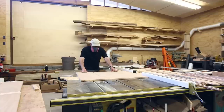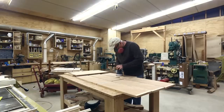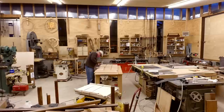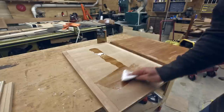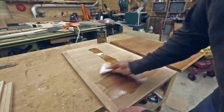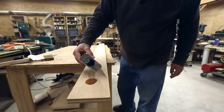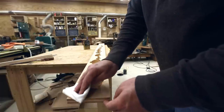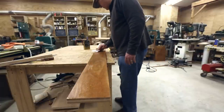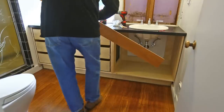The doors are made the same way as the drawer fronts, just bigger dimensions. The trim and plywood were very close but not exactly the same thickness, so sanding got everything perfectly flush. Then I put finish on — just wipe-on polyurethane since it needed to be a little more durable. I also made a base piece to cover the bottom behind the toe kick, out of the same plywood, and once it was dry I cut it to length and put it in place.